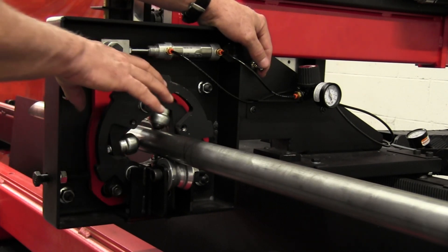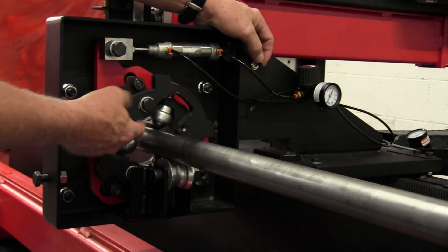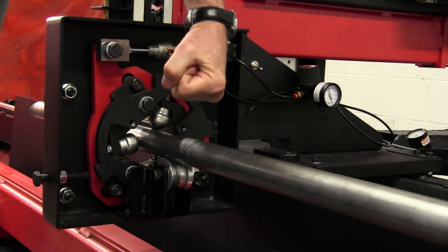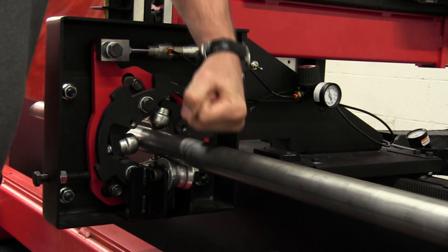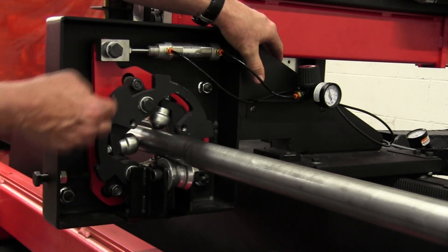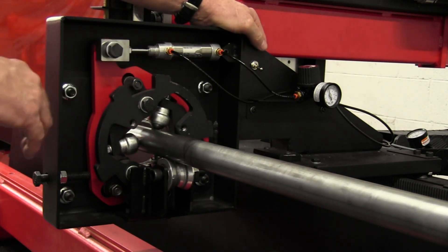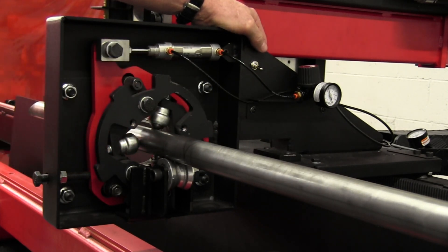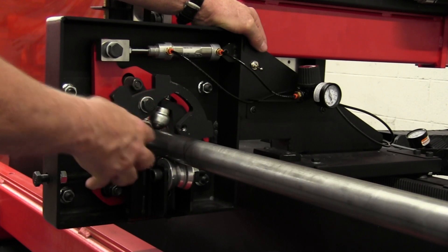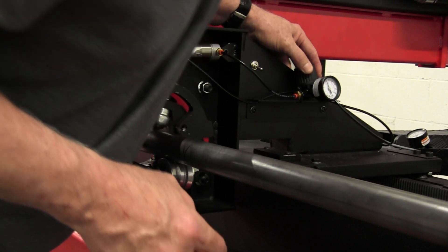This extends the life of the balls greatly — we're talking a factor of 50 to 100 times greater life. Also, if the balls were retracted all the way out to the full three-inch position when they engaged, they would clamp down hard but with a longer stroke, building up speed and potentially marring the tubing. So we added an adjuster right here to limit how far the transfer balls retract off the tubing. We also added a pressure regulator so you can adjust how much clamping pressure is applied — for aluminum or soft copper, for example. Right now it's running at about 80 PSI.